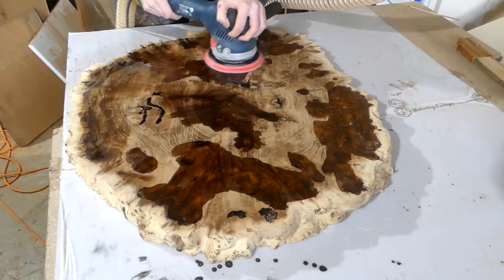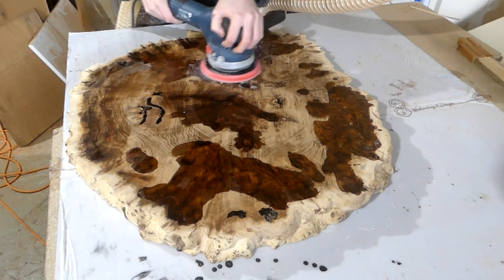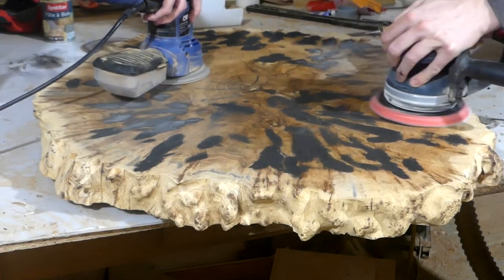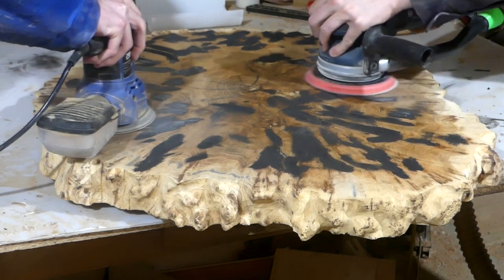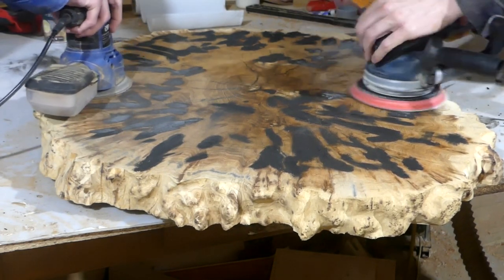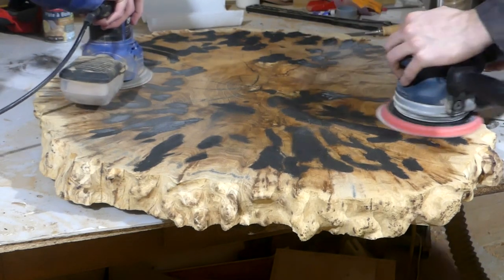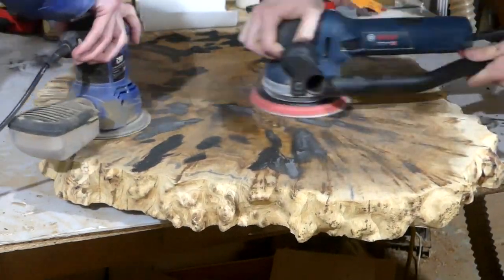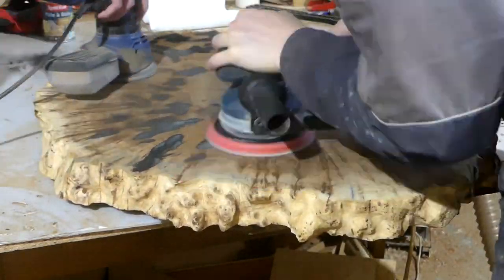After flattening and making small corrections by adding epoxy where it was missing, I sanded down the table with my orbital sander. Another really great method I found was to mix black pigment with wood paste, which doesn't actually seep into the wood, so that's a really great crack filler that's faster than epoxy and gets your results as clean as epoxy for smaller cracks. This process had to be repeated multiple times just to make sure we had all the cracks.